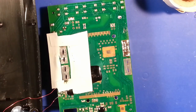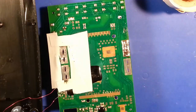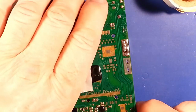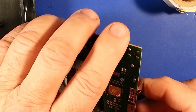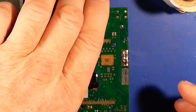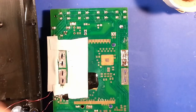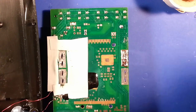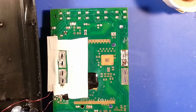That one's not doing the best job of cooperation. I hope to do better on my next attempt. I would say that's not a great solder joint. I was able to move the whole clip. I'm going to try this again. It seems like I have an adequate amount of heat. I probably have to apply it more to the actual battery terminal than the copper pads.